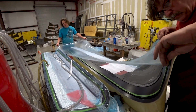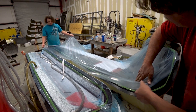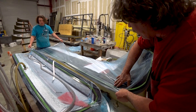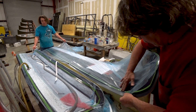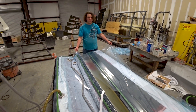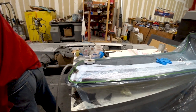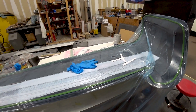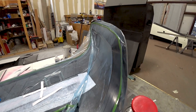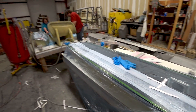There were 16 pieces in all to cut. Meanwhile Jeff and Devin were adding some extra layup to the outer skins for the winglets. Unfortunately when we had them in the post-cure oven, the trailing edges — because they didn't have any core on that very trailing edge — kind of went a little wavy under the heat. So what Jeff's done is added a bit of layup there, vacuumed it down, and that straightened everything out again and added a little extra strength to that area. That's fixed that problem.